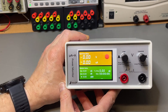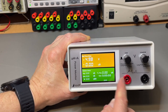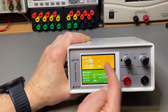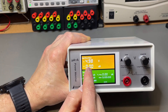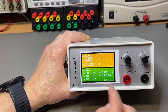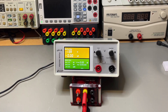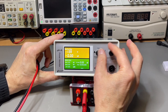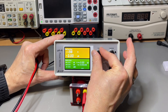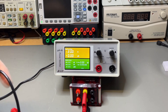Switching it on — this looks pretty nice. White on orange or yellow and white on green. This looks like the current setting. We have a current readout here, so it seems sort of like a power supply. And here we have some statistic values. You can set the voltage with big steps here and small steps here. We have a micro amp readout and I think it can deliver up to 2 amps.